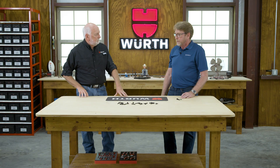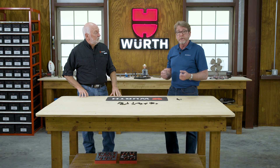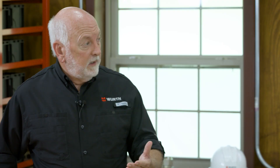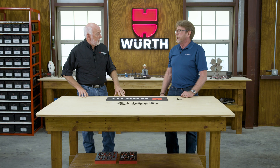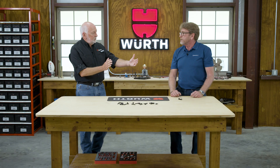Let's start with ergonomics. We were able to reduce the amount of thread-forming torque, which makes it easier on the operator. We were also able to reduce the amount of end load required to start the fastener, so they don't have to push on the driver — hard to make the fasteners start the thread roll. That's critical because it has to do with operator fatigue. On alignment: when the fastener goes into the hole, with this fastener they can't go in at an angle — it only can go in straight.